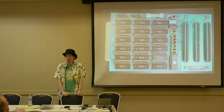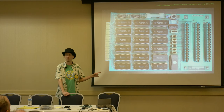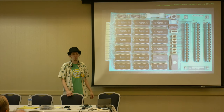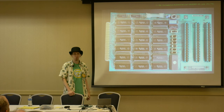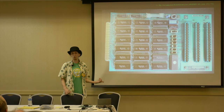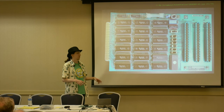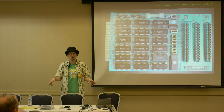One thing as I'm building: I realized I don't want to use a piece of kit that's more powerful than the 6502. I see a lot of folks when they homebrew a machine take the 6502 and bolt it to a PIC or an Atmel or some other high-power modern microcontroller so they don't have to do glue logic. I feel like that's cheating if I'm trying to experience the 70s. So we're going to do it all from scratch. I am cheating in one aspect though — I'm using modern static RAM instead of doing lots and lots of boards of DRAM like you'd find in most Altair 8800s.